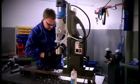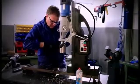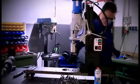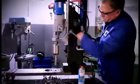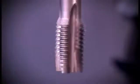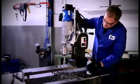Both parts are now inserted into the basic holder. First push the outer sleeve upwards and then insert the quick change insert together with the tap. Rotate it so that the catch mechanism snaps into the proper position. Tapping is made at low speed. Consistently move the machine slide downward after the tap has been sprayed with lubricant spray.